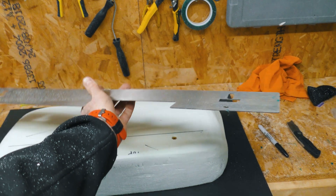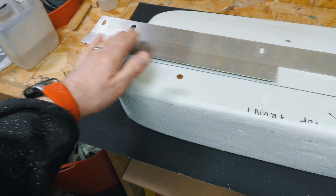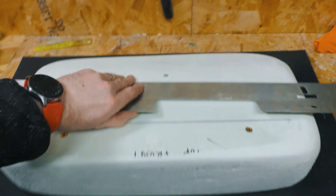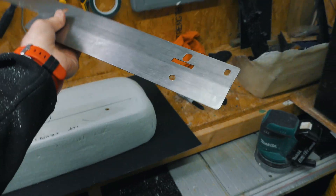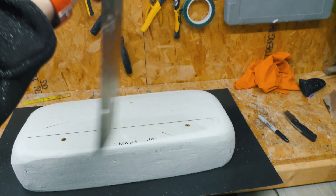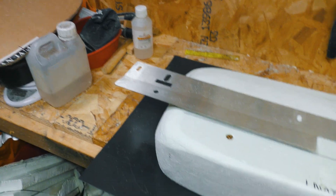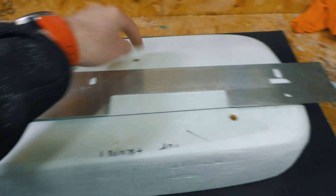But in my studies over the last couple of days I've realised that if I want to make a mould out of that, I'm actually holding a mould. All I need to do is turn it upside down, lay out carbon fibre on the inside of that — which is already smooth — and trim the edges. I went to an awful lot of effort messing stuff up when I could have just turned it over and laid up from the inside. So I may end up doing one of these before I do one of these.